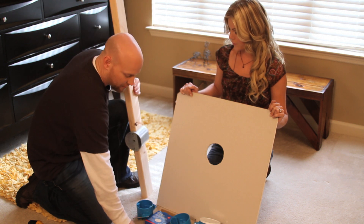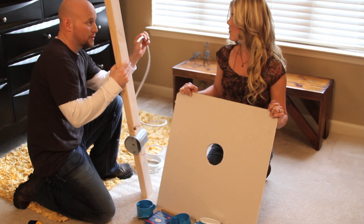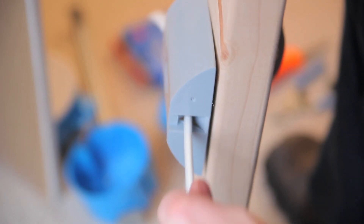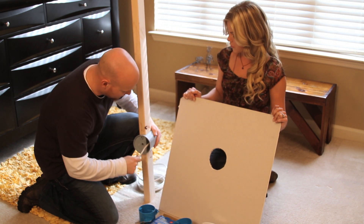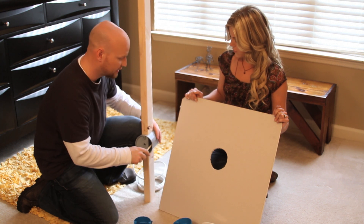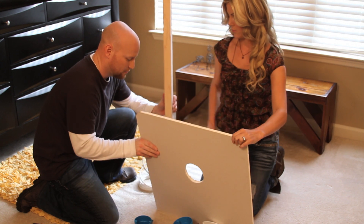What happens after that is we'll go back and install Romex — this is just regular wire that's run throughout the home. We install it inside the box right here so it's accessible to the end user. And then after this is done, it all gets inspected, everything's all good. Then we place it behind the drywall and the drywaller comes and actually installs the drywall.